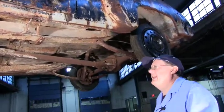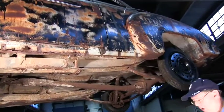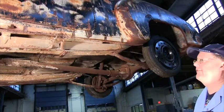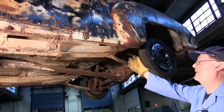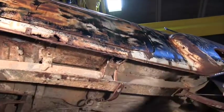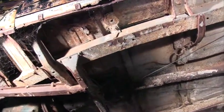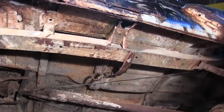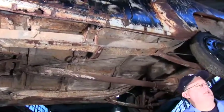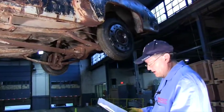It's not that anything can't be done. We're trying to do it the easiest way. Okay, and the easiest way is doing it so we don't have to go backwards. So that's what we're looking at with the floor braces here and this. And then you just come in and you put the floor pans in and it's over with. Then you do some welding. Then you can go to your body rotator and make it easy to do the welding and the grinding and the fitting of all the little pieces and stuff like that.